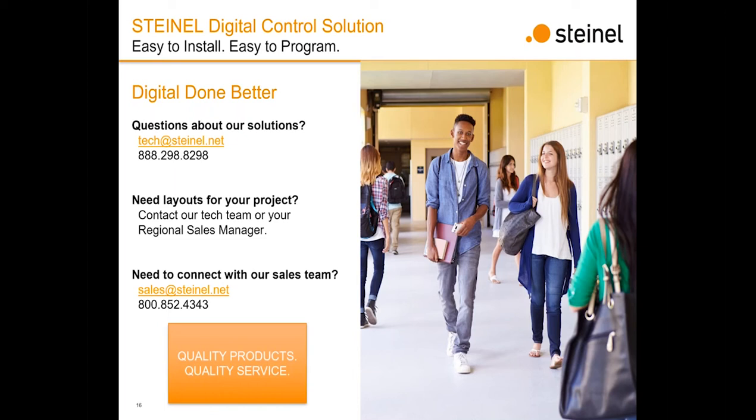Thank you. Will the DCS control 208 the lighting system? Thurston, correct me if I'm wrong, but I believe it is only rated for 120, 277. It will not handle 208. That's correct. But if you need to switch 208, we'll give you a wiring diagram of how to do that using a third party piece. The DCS itself, the relays are single pole relays. So it's not switching both poles of your 240 or 208.